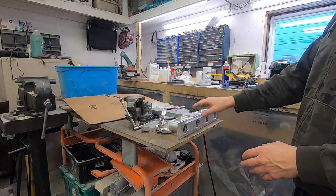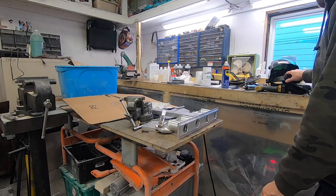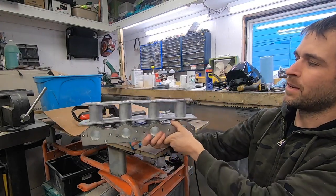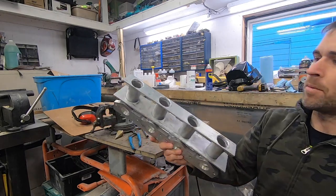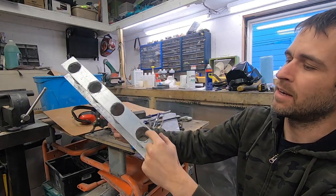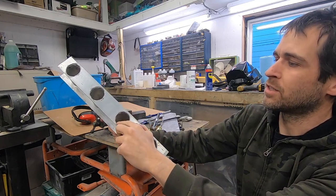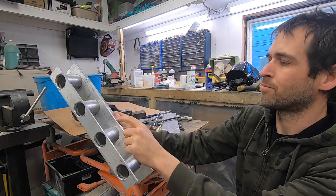I'm not sure if I'm going to be able to pull this stuff apart because I put a lot of heat into these areas, so I'm a little bit nervous about what's going to happen next. It actually took a fair bit of convincing to get this top water jacket plate back to where it's supposed to go. But I got all of the fusion welds done inside of here. The fusion welds are being used as tack welds and also to smooth the transition between the plate and the primary pipe.